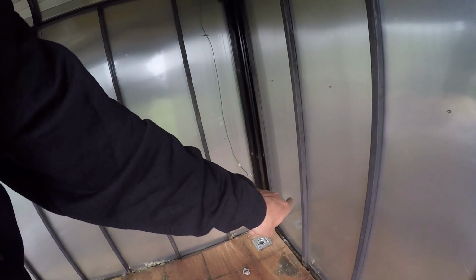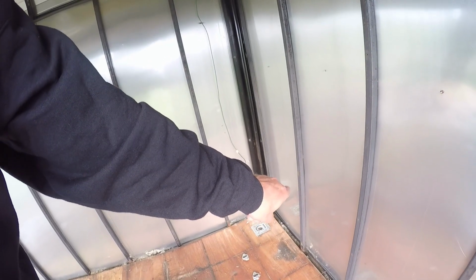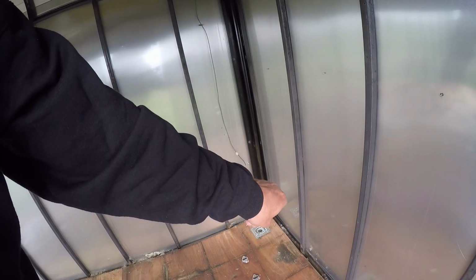I'll put a switch down here on the side of this cabinet, because it might be dark, and why would you want to come in and flip a light? Well, the reason is that's going to be a hollow opening inside the cabinet, and it'll be a heck of a lot easier to put the switches and stuff inside there, because this is all going to be cedar plank siding inside, quarter inch cedar plank. So I don't want to have to try to fit electrical wiring in this tiny little space, because I want to fill that with insulation. This is Wyoming, so I have to think about that.